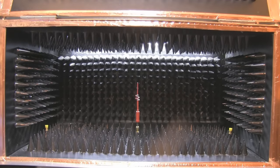Here's the finished anechoic chamber, and I haven't tested this yet so I'm going to test it now on camera. I thought we'd start off with something simple — I've got a small dipole antenna in there that I already know is tuned to 2.4 GHz. I've been working on this dipole for quite a number of months to perfect it. The reason I wanted to develop this chamber was because I was getting a lot of reflections in the lab when testing with the spectrum analyzer — I had to keep really still and not move around, otherwise it would jump around on the spectrum analyzer.